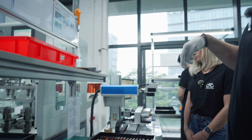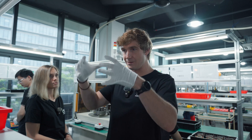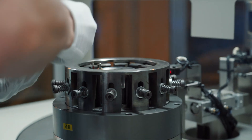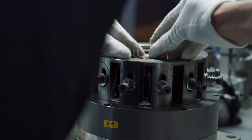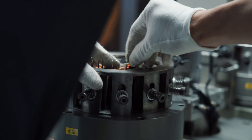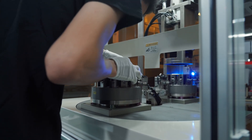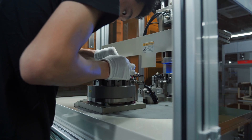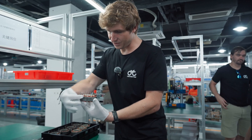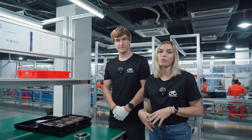After the insulation is removed, the wires are cut and the piece moves to the next machine. All the individual stators are placed together and welded to become a single piece. The individual poles are stacked into a jig with two interlocking parts, arranged in a circle. At the back, a welding nozzle welds each of the stator poles together to make a single piece. Here you can see the end result — all the individual stators are welded into one fixed stator.